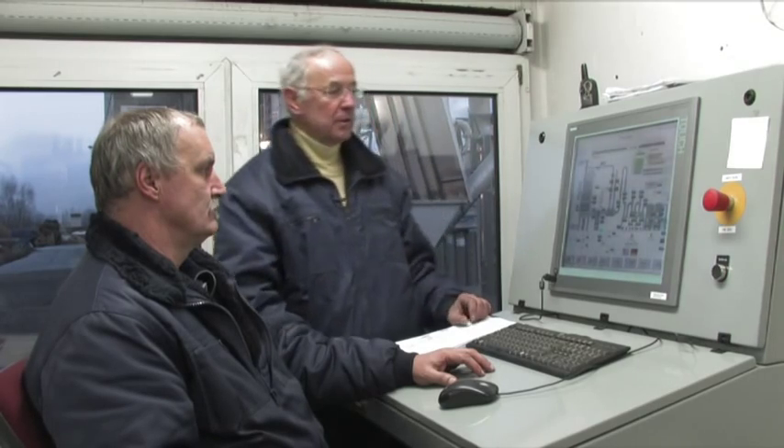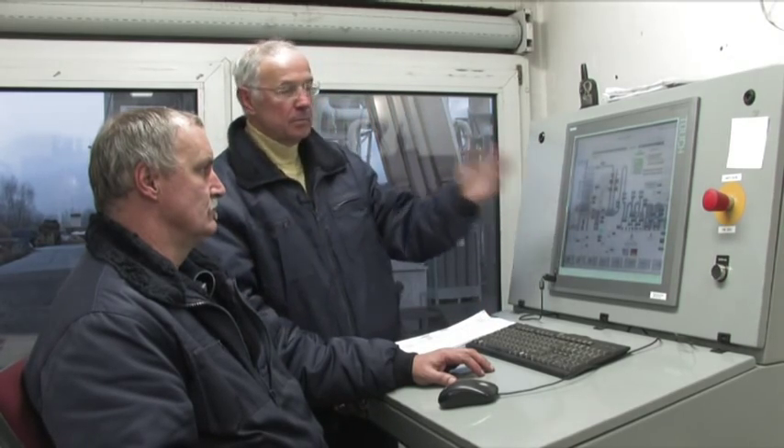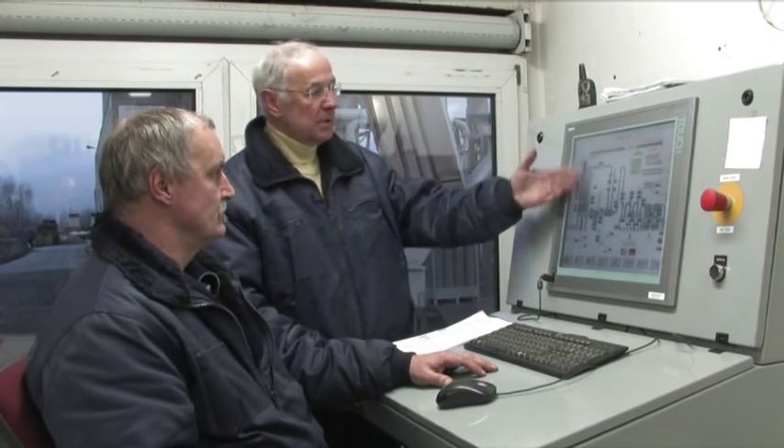We are here in the control room of the plant. In this control room, all monitoring takes place. One of the two colleagues responsible for operating the plant is seated here; the second colleague is responsible for monitoring outside the plant. The gasifier, as seen here with all its temperatures, delivers a thermal output of 4.5 MW. At a wood input of 1.2 tonnes per hour, 3,100 standard cubic metres per hour of gas are produced.